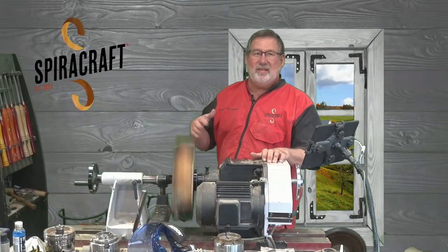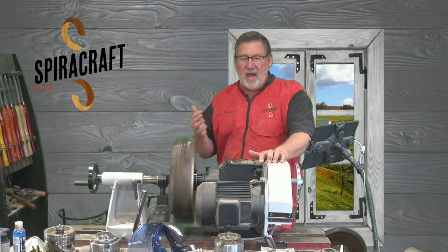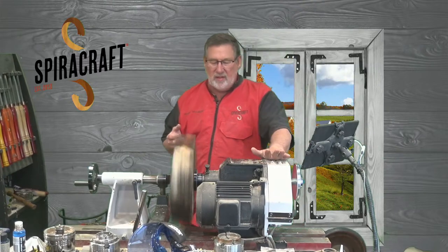So we popped up to about 700. Now, also, remember the faces are not trued, so that will help a little bit. So it's still got some vibration, but not too bad. As things settle down here in the shop, it won't be too crazy. And so I'm letting that sling any water, bugs, all that stuff out of there. And as we get this trued up and the mass out, then we'll take that speed up more and more. So it looks like about, well, that's 689. So I know that that's roughly where I'm going to go, somewhere around the 700 mark.